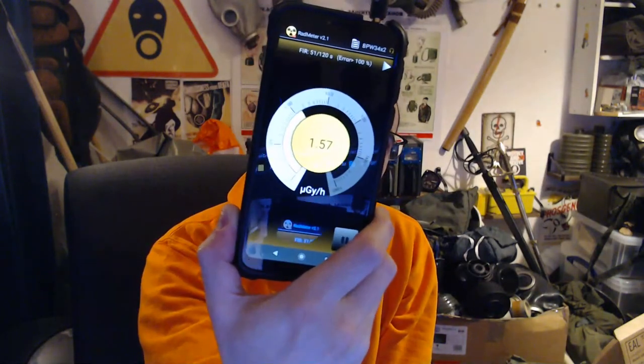It'll probably drop down to about 0.2 to 0.3 microsieverts and stay there, but these definitely work with samples — as I've demonstrated before. Let me see if it can pick this bit of radium up. Not really — the weird thing is, unless this is a post-radium model, because I said it glows like radium and these were supposedly painted with radium, but this one doesn't seem to set any of my Geigers off. The official detection range of these goes up to 200 microsieverts, but they actually do more than that — I've tested them.